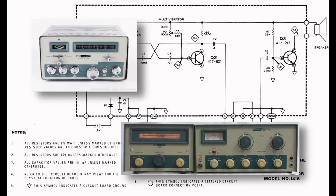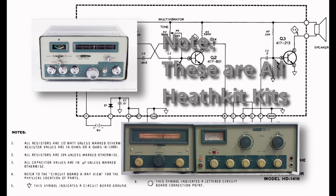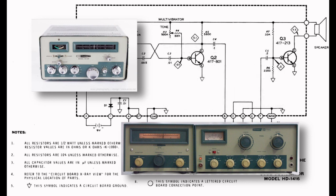Here are a couple of examples. I have used both of these transmitters, by the way, but the code practice oscillator could be used to key the transmitter through the ST connection, giving a nice side tone in the speaker while you transmit. A simplified explanation for the diode is that it's there to protect the rest of the code practice oscillator circuit from back voltages from the transmitter.